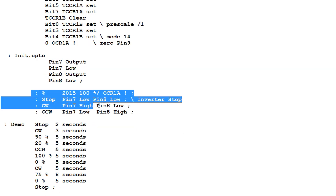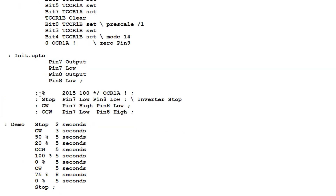The next four words are the heart of the commands. The first word is 'percent' — typing '0 percent' gives stop speed, '100 percent' gives maximum speed. Typing '50 percent' takes 50, multiplies it by 2015, divides by 100, and puts that value into the output compare register, giving a pulse width to drive the motor at 50% speed. Next is 'stop', which sets the optoisolators for a stop configuration. 'Clockwise' sets the optoisolators for clockwise, and 'counterclockwise' does the same for counterclockwise direction.